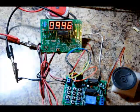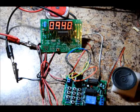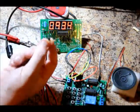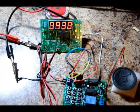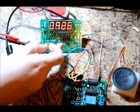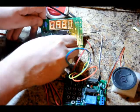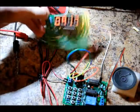So there we go. If you want to re-enable it during your game, I don't suggest doing it because you will likely set it off. Enabling and disabling that vibration sense should only happen during power off mode. For fun, we can try it in operation. I have a feeling that it's not going to end well. It's going to start counting down. But again, if you want to re-enable it, take your jumper, don't lose it, and reconnect pins 1 and 2. And hey, I did it. So now I'll shake it.